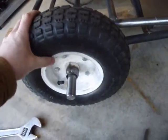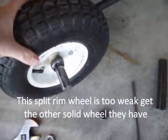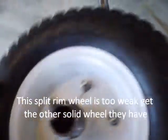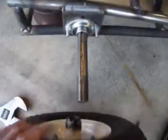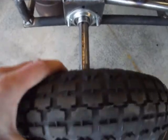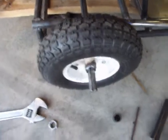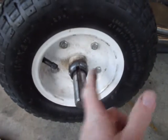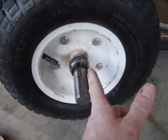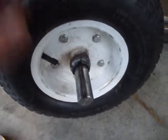And this is a $13 tire. It's more like a wheelbarrow hub on the bigger tire in back. And so it's the same thing, it's got the keyway in there. And it just slides on really nice, and it's a good lock. It was a little bit loose, you can see the gap right there. It's a little bit of a loose fit. So I just welded some little spots inside of here and filed them off to where it fit a little more snug.